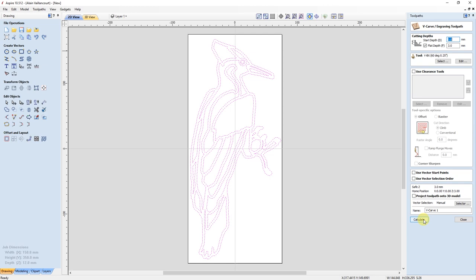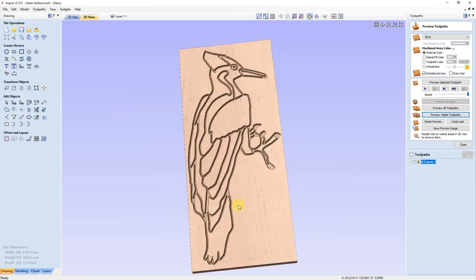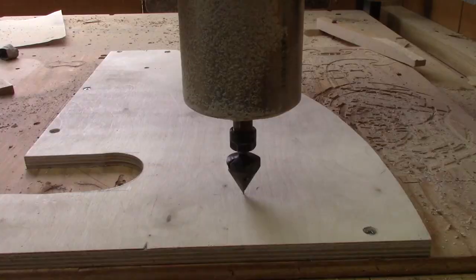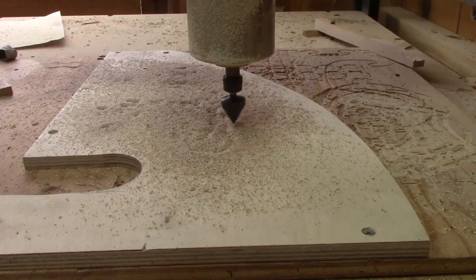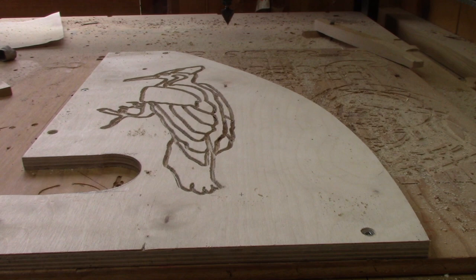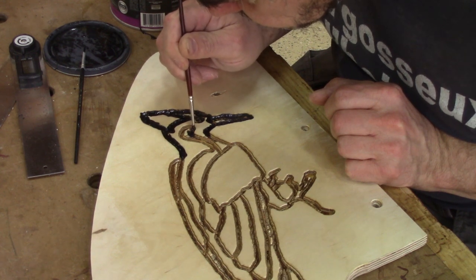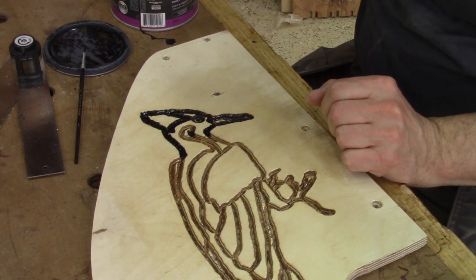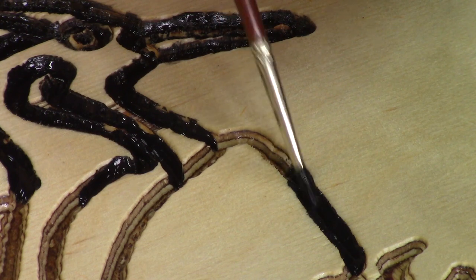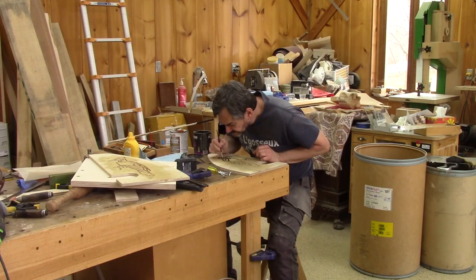I just have to import a bitmap and turn it into a vectorial shape that I can export as a v-carve. With this file, I can go to the CNC and carve them. One carving is facing right while the other one is facing left. Even if this is exactly what I want, I would like it to be more visible. So I brush a coat of shellac on the birds. When it's dry, I carefully paint inside the v's — I take care not to overpaint. It's the reason I brushed a coat of shellac, to make sure the paint wouldn't seep into the wood.